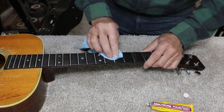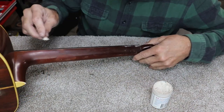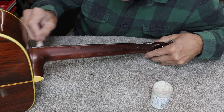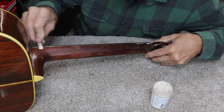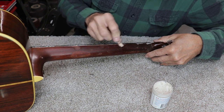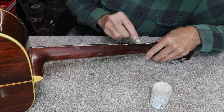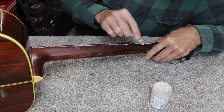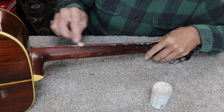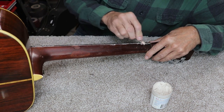All I've got to do is polish the rest of these, then I'll clean up the fretboard. I'm doing a little detail work on this guitar. After taking the fretboard off, there's always little microscopic holes and things, even sometimes a groove right there. So this is kind of the ugly duckling step — I just take and rub this Timbermate into that crack, and it does penetrate a little bit. There's almost no penetration because there's almost no crack, but it fills in the little tiny voids and will make it look better when you're done.